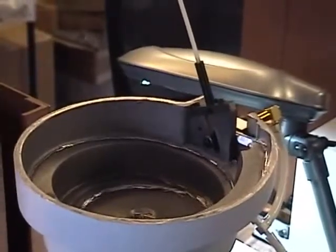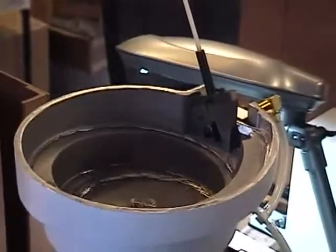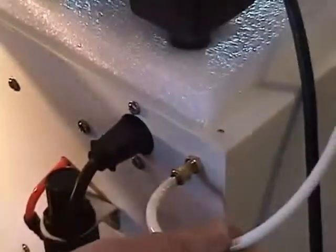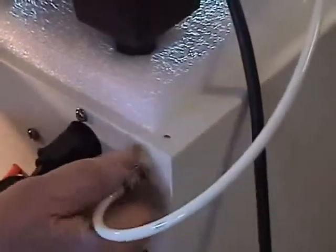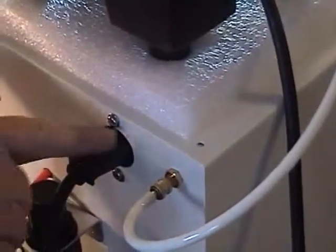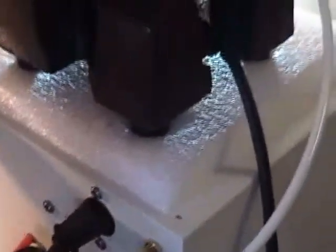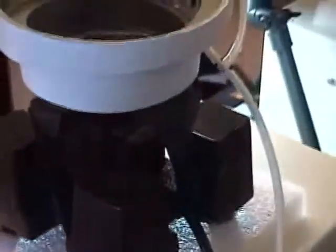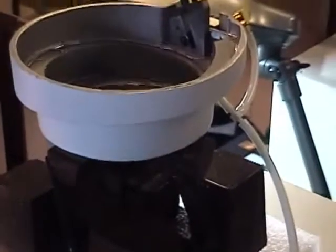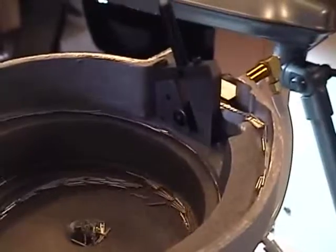When you receive the machine, you will connect the air pressure here tightly with this line, and you will plug the vibrator into the side of the machine. This vibrator will plug in air-wise into the side of the welder box and also plug in at 110 volts on the side of the machine to operate the bowl.